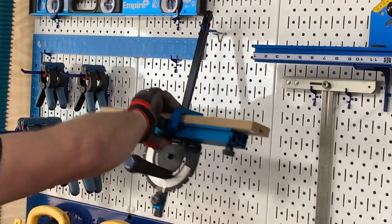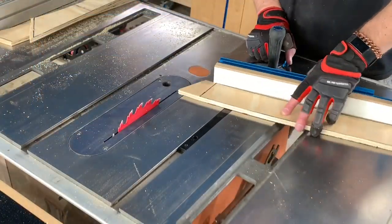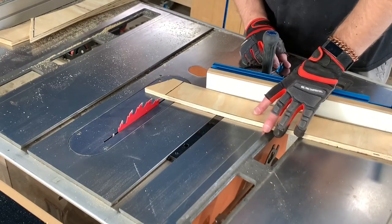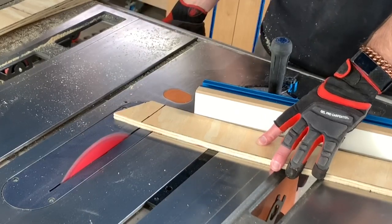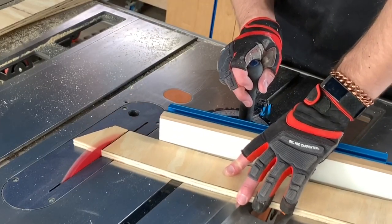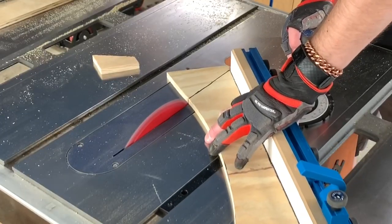Now that all the shapes were cut out, I got out the miter gauge and headed over to the table saw to start cutting the angles that would ultimately be the miter joints for the stretchers and legs. None of these angles are really known, as I modeled them to what best fit the base in my design, so I had to cut them to the line and not a preset or a round number on the gauge.